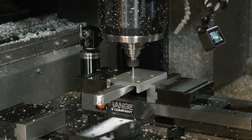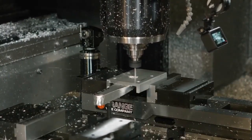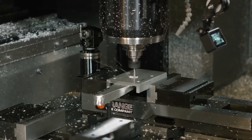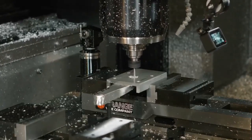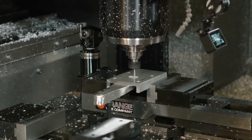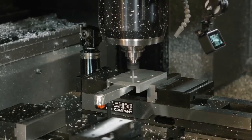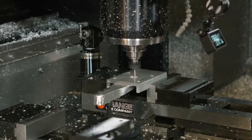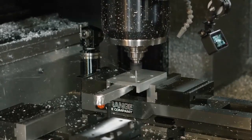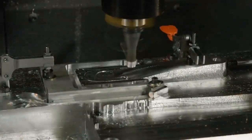This is a demonstration of the back side of the spider and crank arm assembly. We're opening up a pocket that our titanium 6-4 shaft is going to go into, getting it ready to friction stir weld it from the other side. Here we're just opening up this hole to drop in that shaft.